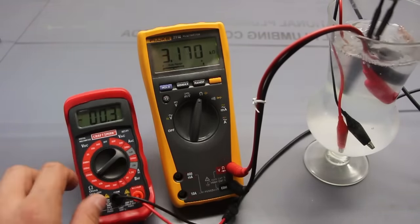So when someone has the toaster and the microwave on, it's very evident why a fuse can go out, especially in these older homes that have a 10 amp fuse. You put a toaster on, you only have 3.3 amps left before the fuse blows. And you can also notice that the resistance is increasing because these coils are getting hotter and hotter inside this toaster. And as those coils get hotter and hotter, it increases resistance. All six and three quarters amps are going through that multimeter.